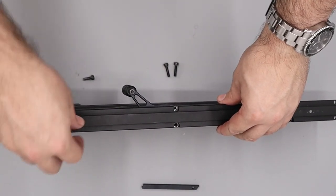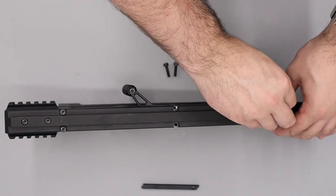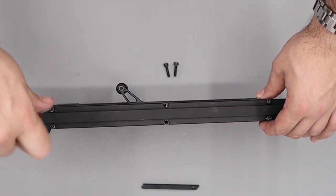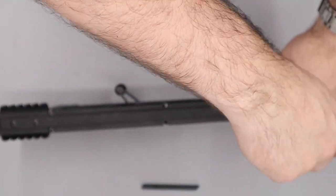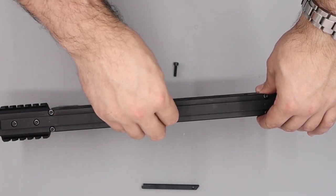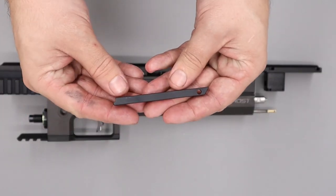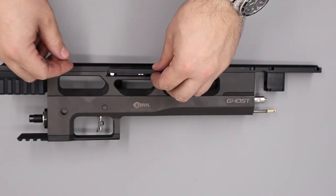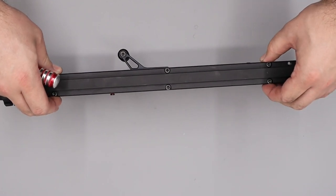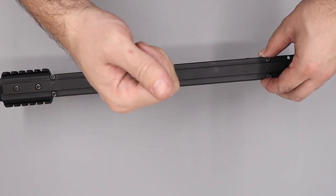Add the securing screws: the two at the front and two at the back of the block are M4 by 16, and the two in the middle are M4 by 20. Get those started with a 3mm allen key — don't tighten fully yet; get them all started first, then add the two longer middle ones, aligning the cocking arm with the hole. On the other side, add the cover plate — it has an orientation with a small cup that hooks in from one side. Check the top rail is aligned with no bigger gap on one side, then tighten all bolts down and confirm the cocking arm moves freely.